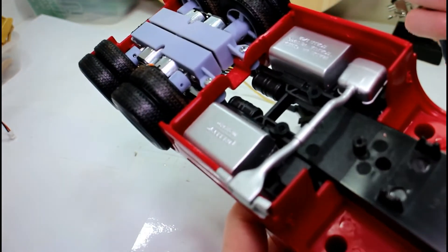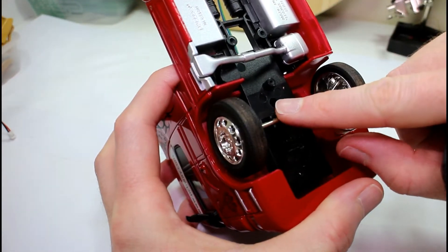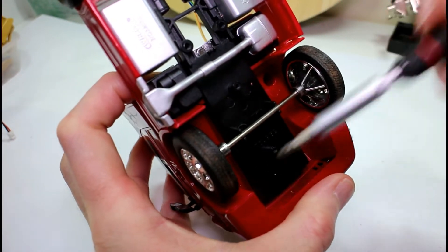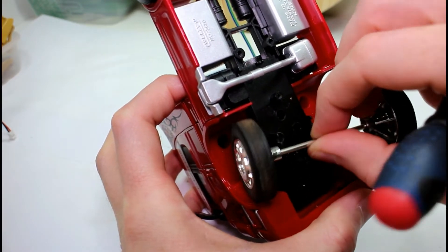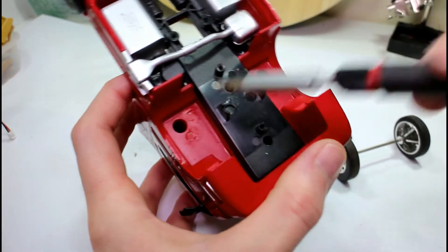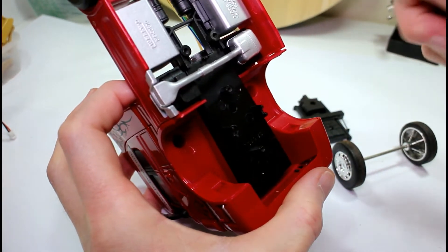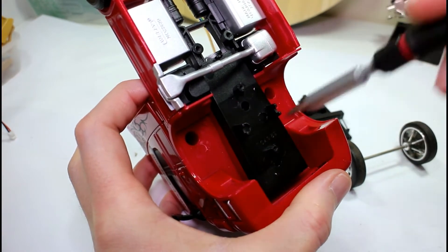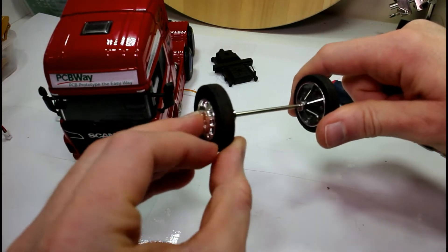These very thin little tires aren't really going to suit the look we're going for — we've added wider tires to the back. The tire is very close to the mud flap, and it's the same story at the front. If we're trying to turn those tires, we need a little bit of room forward and back, so this mud flap is probably going to have to go. A big chunk of the front one will need to be removed to allow steering, and also to leave space for the motor to twist on the opposite side of the pivot point.